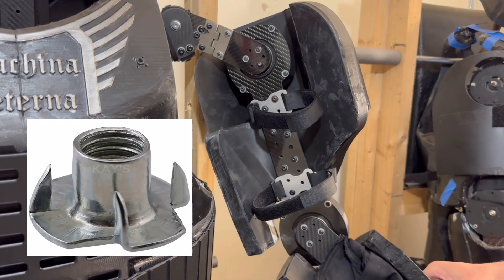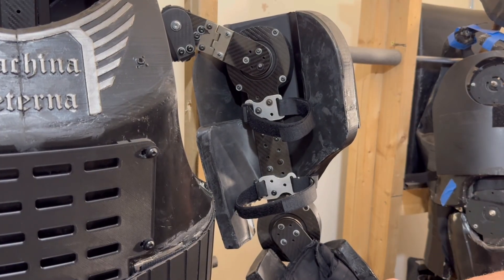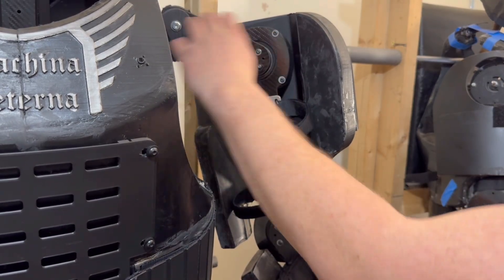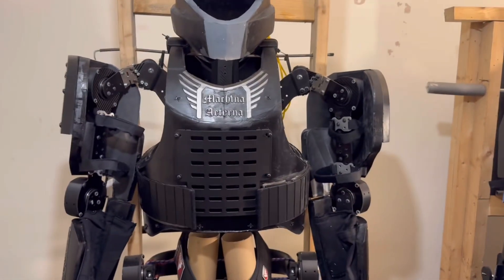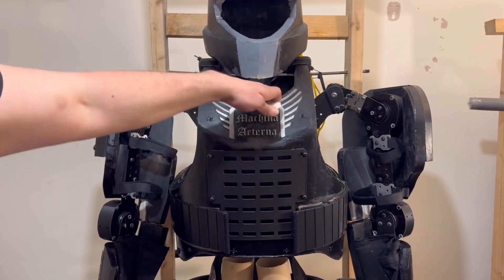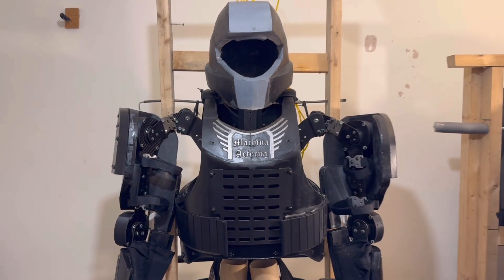So I've decided to 3D print a layer first to make sure it's going to fit right and so I can alter it in CAD — which was a good idea because each panel ended up being five to ten millimeters out on the corners, meaning the bolt holes wouldn't be in the right place. I'll have to come back to that later, but using 3D printing and T-nuts will allow me to test everything first. Also worth noting: the carbon fiber exoskeleton looks a bit saggy on the frame as it's all leaning forward right now.